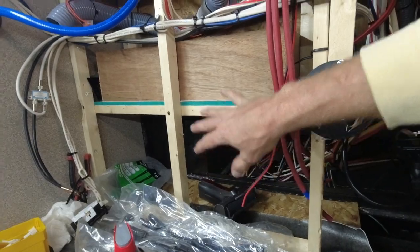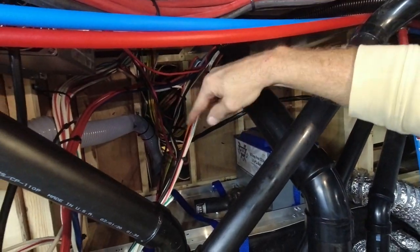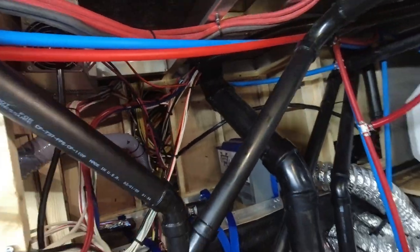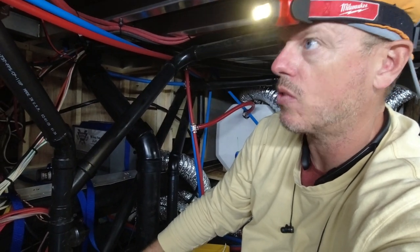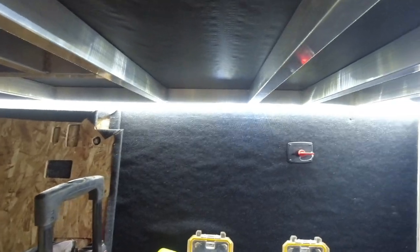And then for this one down here, there will be two MultiPluses, three MPPTs up in this area, and then the battery bank is over here on this deck. So there'd be four, and then two more, one, two, up above. So this system will have six batteries, two inverters, three MPPTs, totaling 2600 watts of solar, or managing 2600 watts of solar. I've already done the LED lighting upgrade, which I'll spin just a little bit this way. So I'm sure that was super bright, sorry.